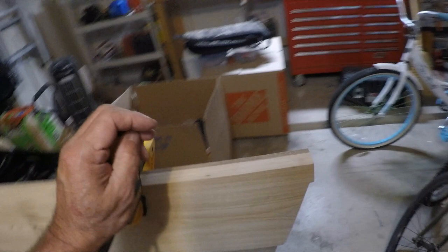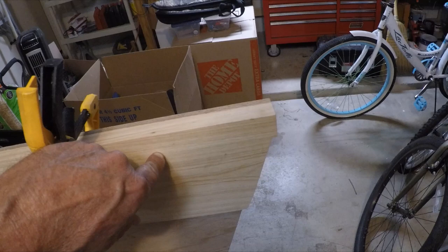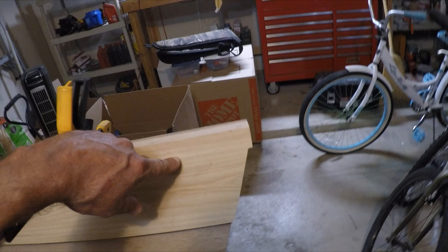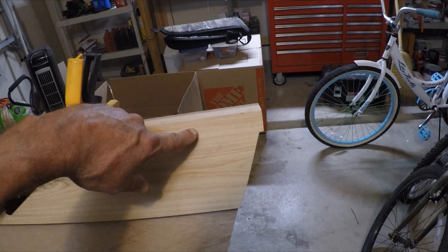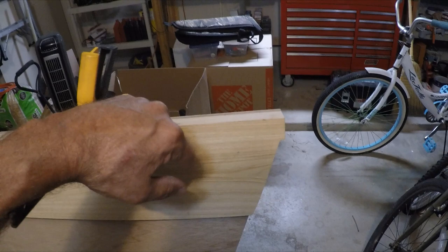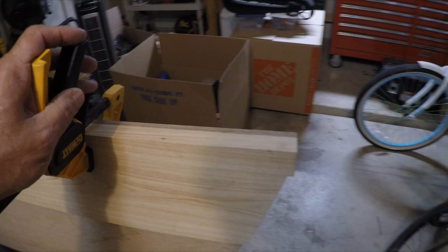What I've got to do is notch out right here, and the reason for that is I've got to have a place to attach the sidewalls and the gunnels — which are the sides of the boat — and I've got to have a means of attaching the structure, and actually attaching the transom to the gunnels, so that we don't have a weak point and there won't be any cracking out right here whenever the boat is finished and put together on the water, once you start hitting waves and chop and putting stresses on the frame.